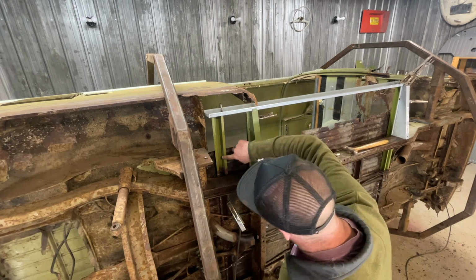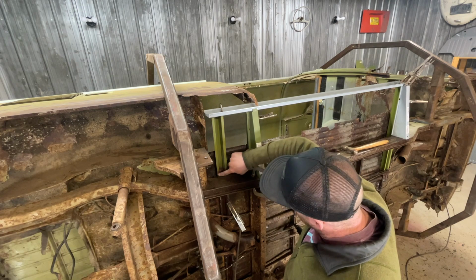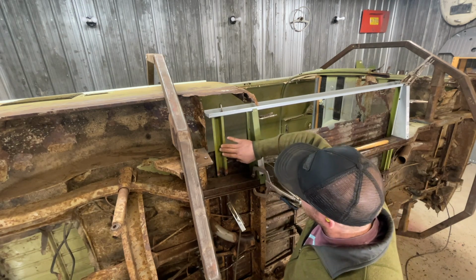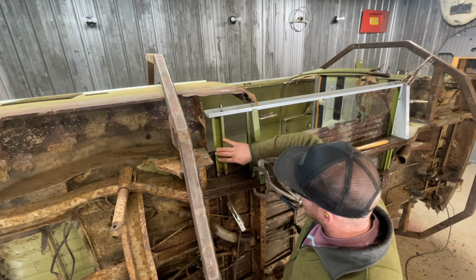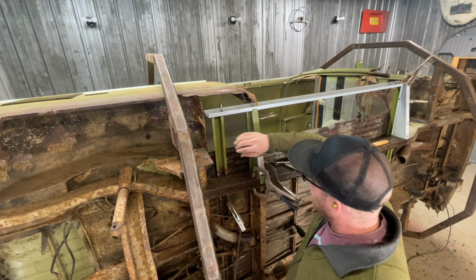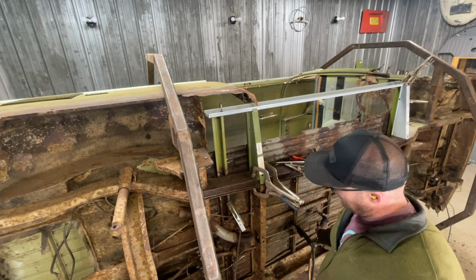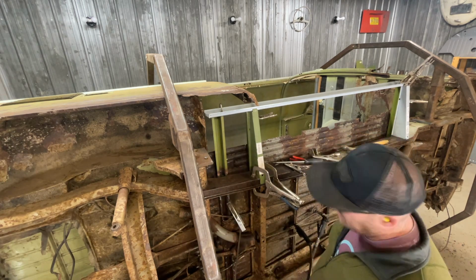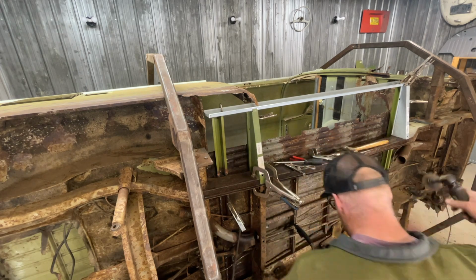Okay, I got this welded on here. I'm gonna grind these off. Inside the welds are pretty gross, but the German steel welds so much better than this new steel. The new steel is so soft, it just burns right through so fast. But if you're careful, I put a bunch on there. It's definitely strong and it's definitely not pretty, but I will put that cover on it so you'll never see. I'll just clean this up here.